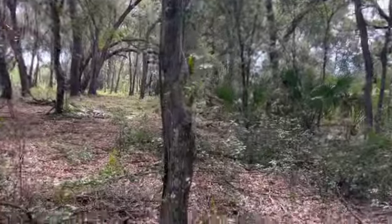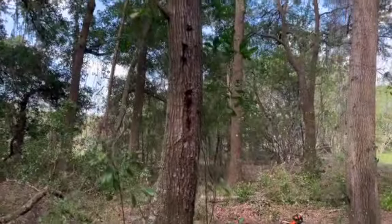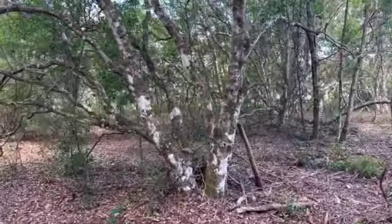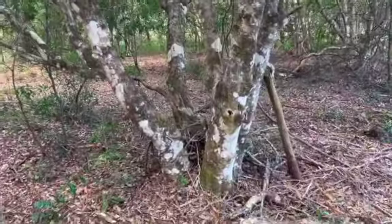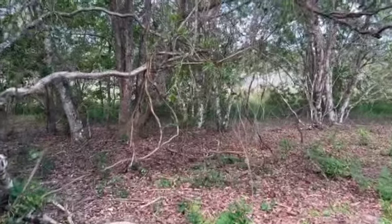This tree isn't on the fence line but it's broken off at the top and the woodpecker is just tearing it up, so I'm going to take that out anyway because I'll have to do it eventually. The last things to contend with are these trees here — all dead on center. That's one, that's two, that's three, and then four is back in there. The chainsaw got really hot and the chain was feeling really restricted, so I stopped. When I opened it up it looked like the chain was off near the gear, off the bar — that's a bad thing. I need to put it back on and hopefully I didn't do any damage.